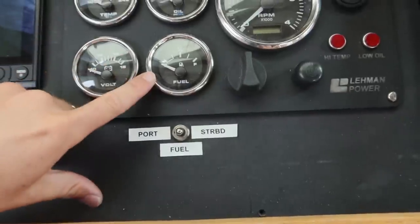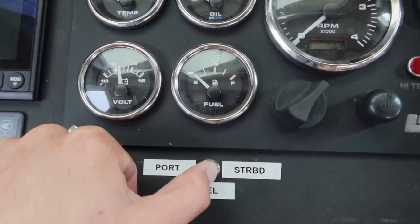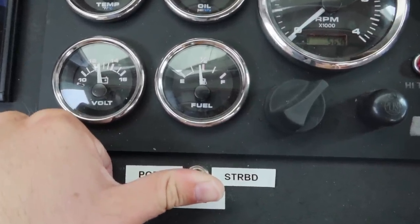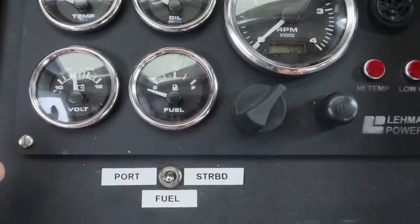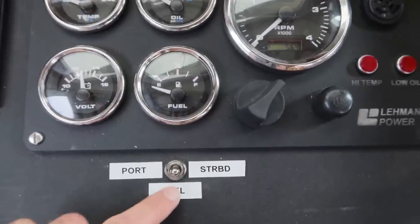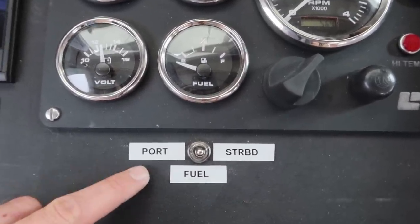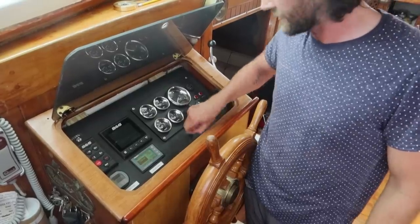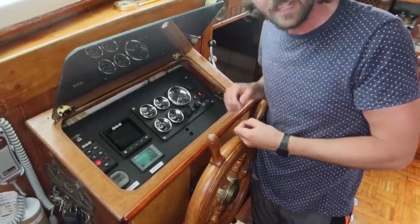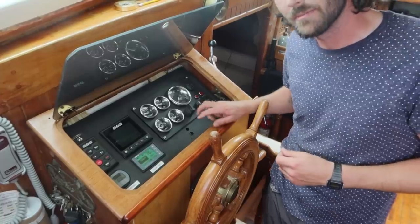One of the last projects with the third fuel tank is to wire up the fuel level sender. We have the fuel gauge and this switch where you select tanks — you have to have the ignition on and it's a momentary so you hold to port or hold to starboard. I don't really like that, so I'm going to replace the momentary with a switch that just goes on to one side, on to the other, off in the center, and add a second switch below for the forward tank and eventually a day tank. Drilled a second hole, used the vacuum cleaner to spot-clean, and used a chamfer tool to clean the edge before inserting both switches.